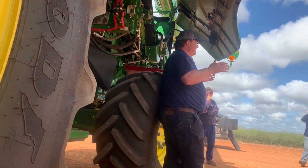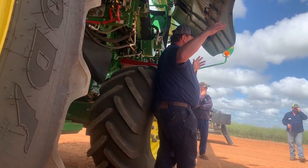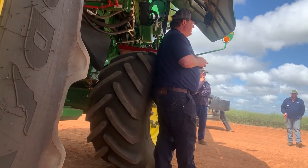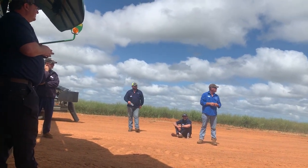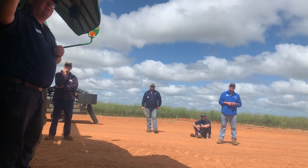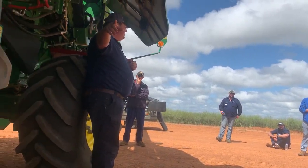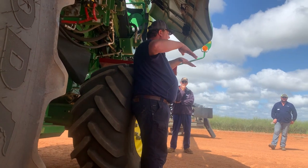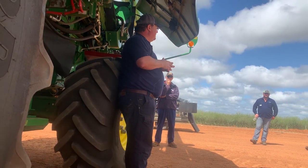One of them is top cross auger, one which makes a difference. So bigger top cross auger? Yep, the bigger, the slip clutch. Yep. And the hydro motor one. So the slip clutch here is stronger, all your motors are bigger so you get more torque on them. Yep. And they've also changed the angle of the 740 back from the 600 series. So your angle, facing your angle is different as well.